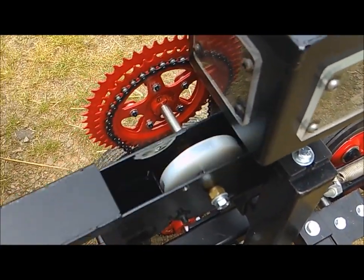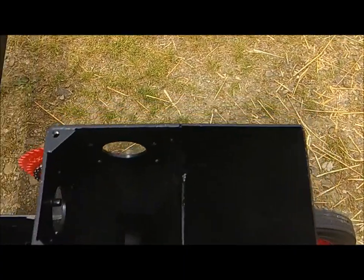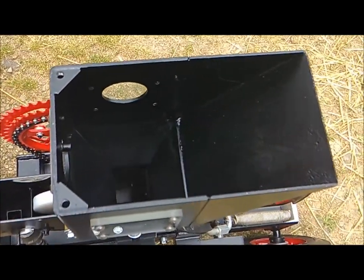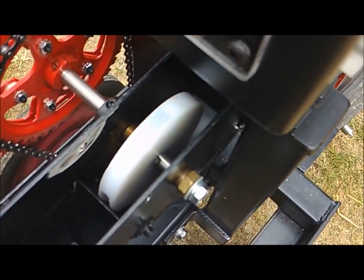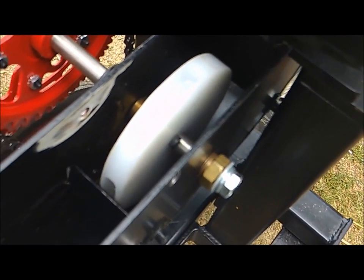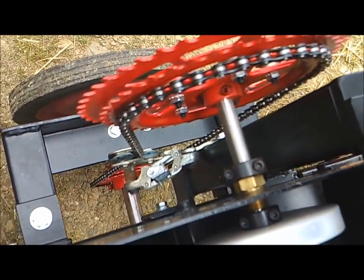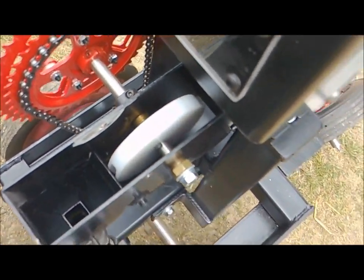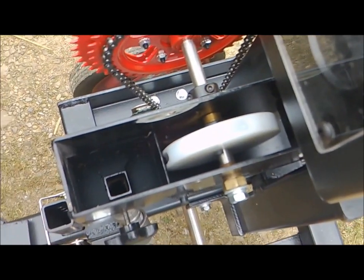I'll take these covers off and show you what's going on here. Here's the feed hopper — you fill this up with your corn, bean seeds, or any large seeds I feel this is going to be able to handle. Those are going to go down filling this chamber. I have little scoops made into this chunk of plastic — there are four of them. Through the sprockets off the old bike, I came up with a combination where as this rolls along the ground, about every 9 to 10 inches this thing scoops up a seed, throws it in, and from there it travels down the feed tube and into the furrow.